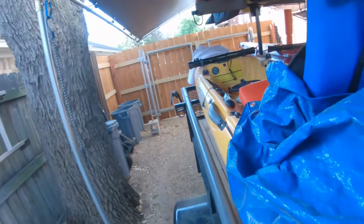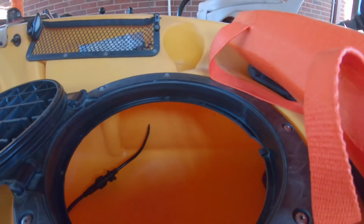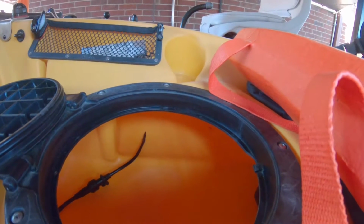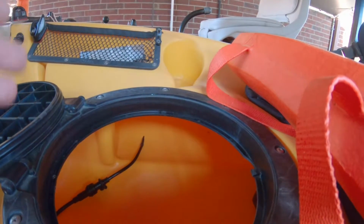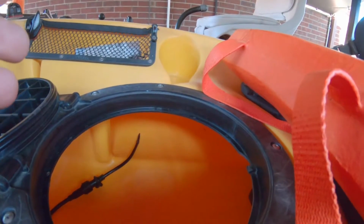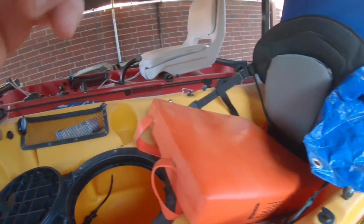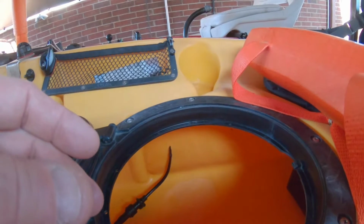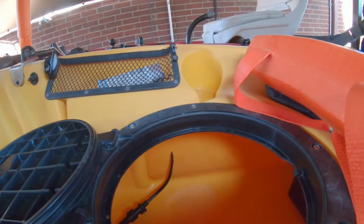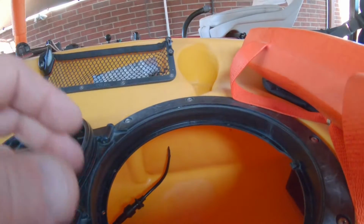Coming forward, I'm going to be using an 8 amp hour lithium iron phosphate battery, so we can get close to 8 amp hours out of that battery. I did test amp draw in previous videos. I did an amp draw without the check valve and discharging in that smaller discharge, and then I did an amp draw with just plain hose, and believe it or not, the amp draw with the plain hose was higher.